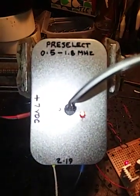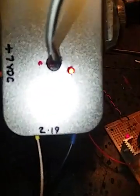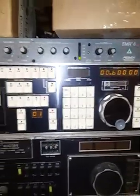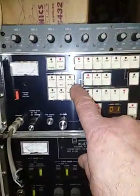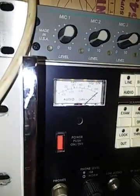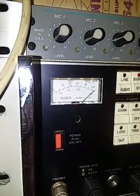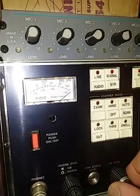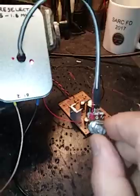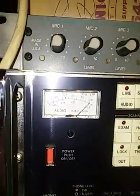We're back — there it is, all closed up. I put a little LED in there so that if there's ever an issue I know at least the unit is getting power. Over here at the receiver I'm around half a meg — 600 kHz local AM station. I've got the AGC shut off. You can see it's plus 35 dB on the signal strength meter. I'm using that as a reference. That is peaked — I'm now going to adjust the pot.